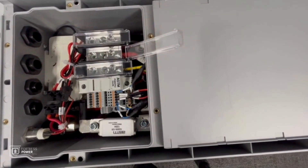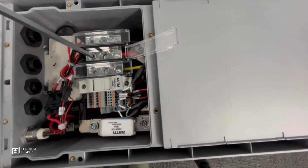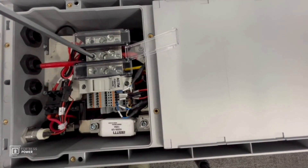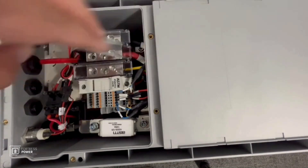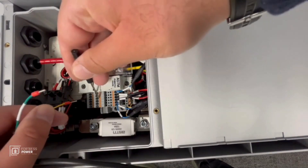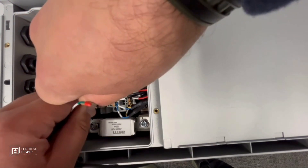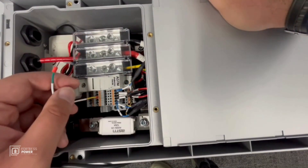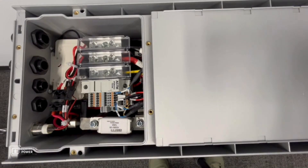Here's an example of putting in the power cable: you unscrew the screw in the busbar, slide in the cable, then make the screw tight. Give the cable a gentle pull to make sure it's in place. Repeat the same for the negative and ground cables. For communication cables, you see these orange buttons — press in to release the mechanism, slide the cable or ferrule through, and release the button. Now I'm pulling on it and it stays in place — once you release the orange button, it latches onto the ferrule.